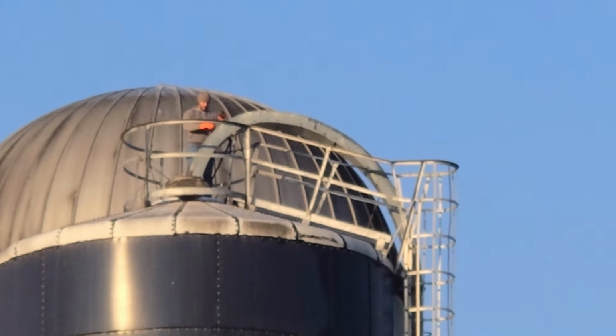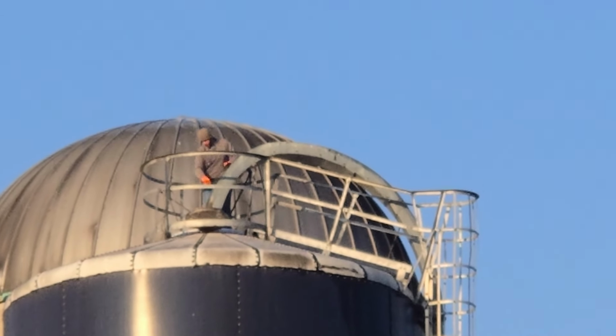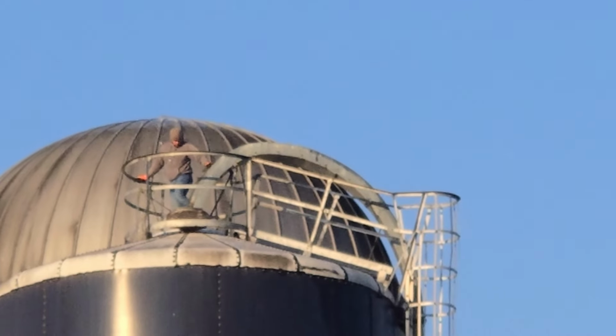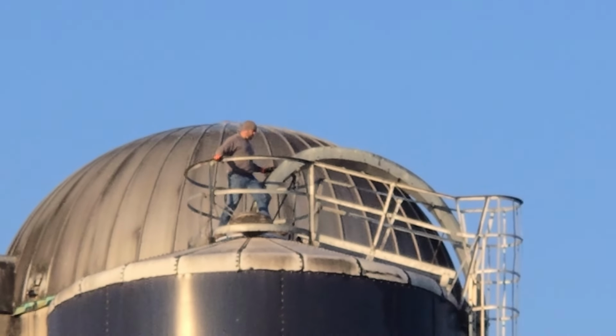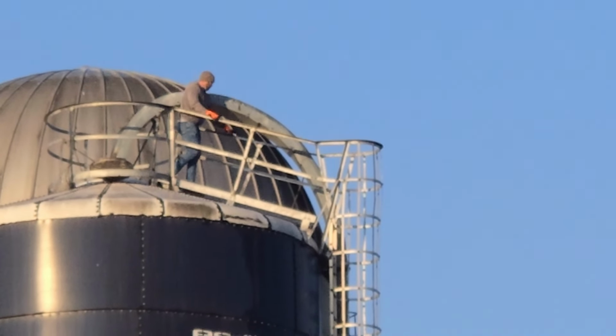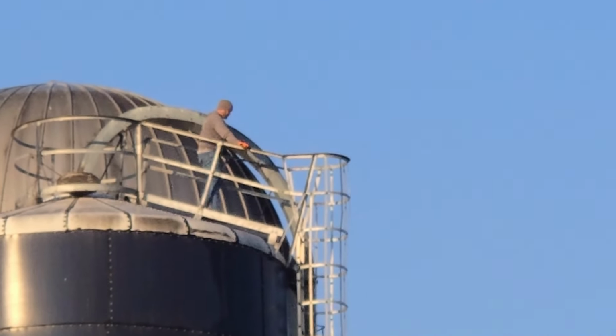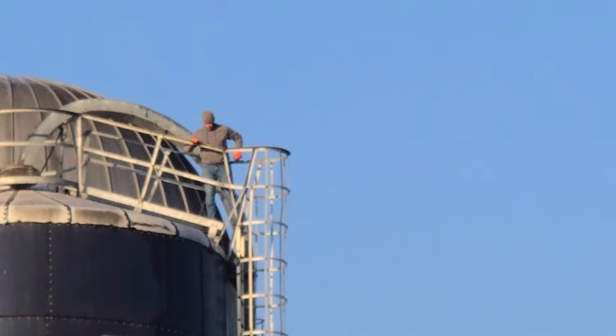What he was doing right there at the beginning, there's two airbags that hang down in the silo about 10 feet, and it's connected to strings. You gotta pull them up. It kind of folds them in half and then tie them up. Otherwise, when it's getting about full, it'll pinch it, or it could possibly pinch it against the wall. It's like a catwalk, comes down from the center down to the ladder, and then there's a cage on the whole ladder.